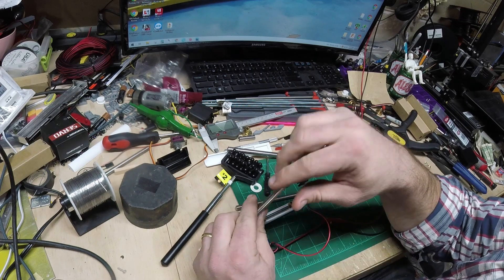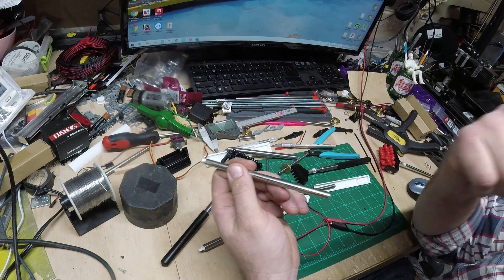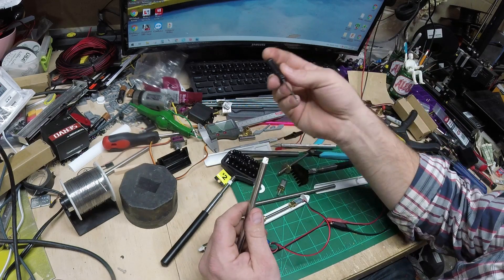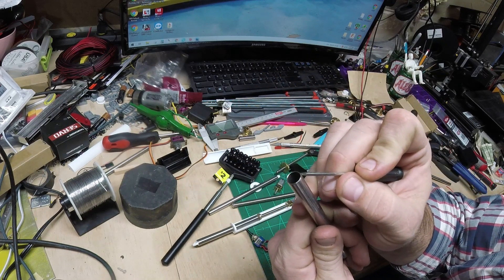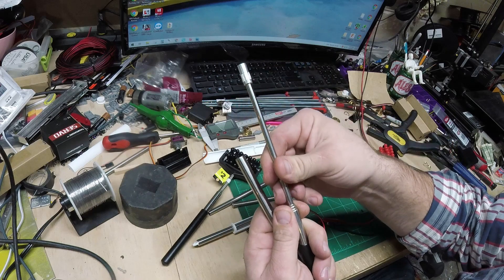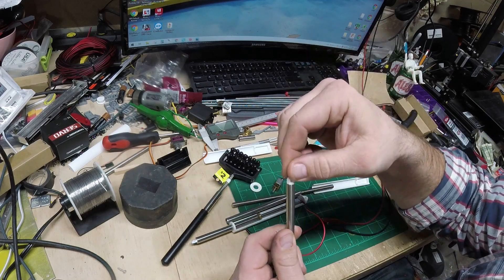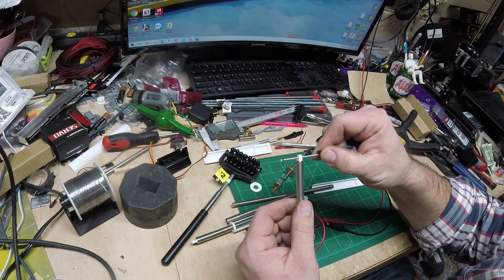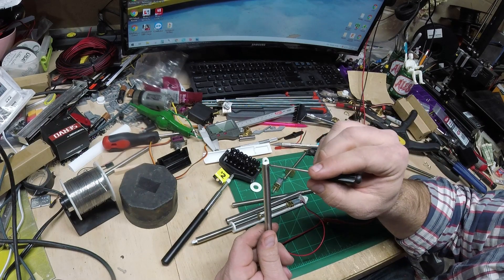I got my micrometer out, measured the inside diameter, and then 3D printed the rod end that just slides down in there. It's a really tight fit, so I actually have to press it in place. I was worried about having to drill a screw or put something else in there, but once it's mounted it's not going anywhere. If you'll notice, the end of these rods have a curled lip, and that's what gives the tension from one tube to the next. So this rod end cannot pull out - it's going to break before it pulls out. And if I have this bolted to something to run up and down, it's not going to go in either because the bolt will keep it there. I thought that was a pretty decent solution.